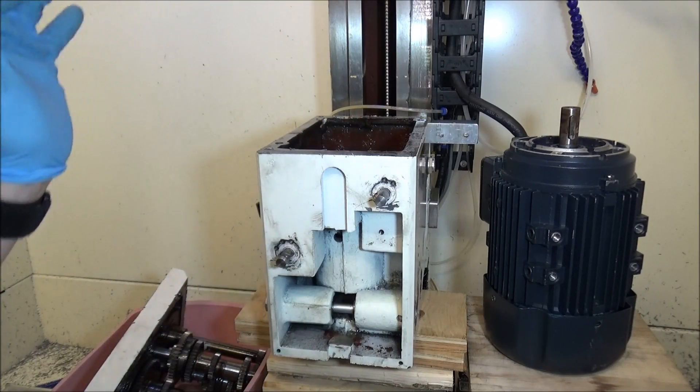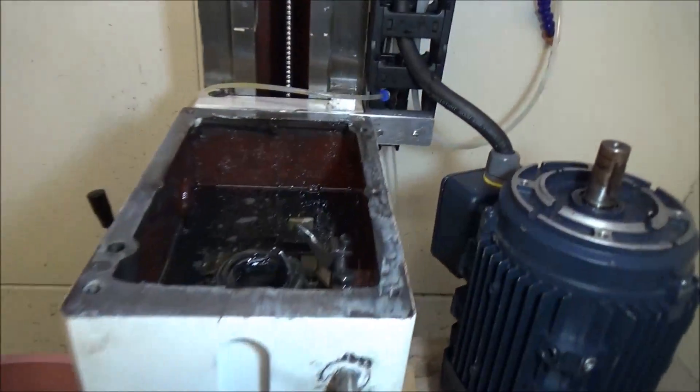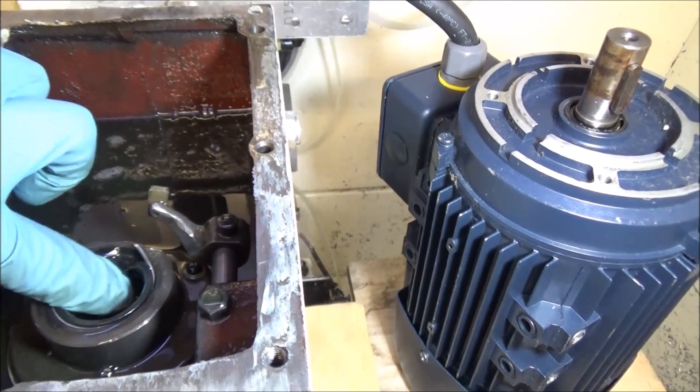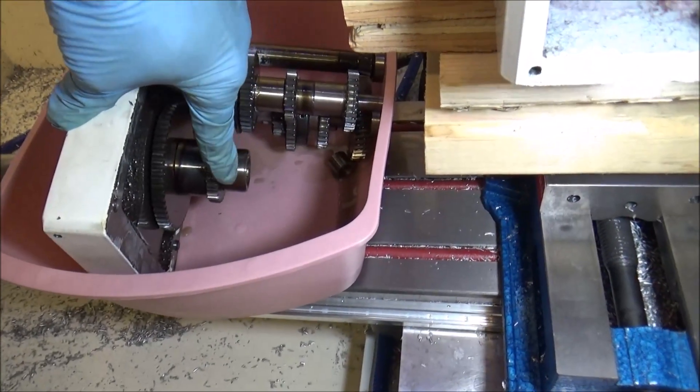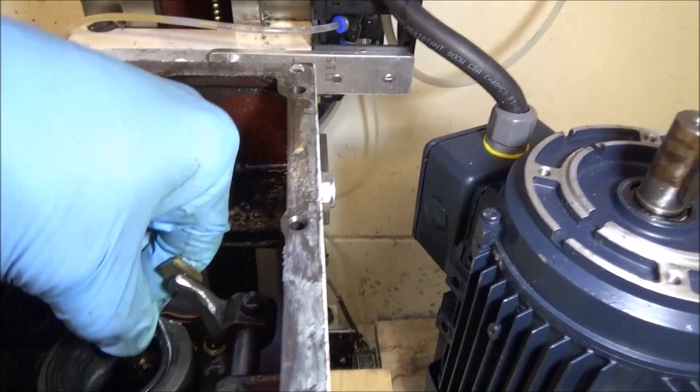I've been complaining to my buddy Wyatt that I was getting some oil weeping and dripping — it comes out this weep hole here and then drips down and gets on my spindle. I noticed that the first time I re-greased my bearings, the grease was kind of washed out, and I think I see why now. I never took the lid off here, but you can see the seal right here — the seal is just all bent. It looks like when it was installed they must have mashed it. That's where this gear seats on there, so all this time it leaks. That's not going to be able to be repaired.